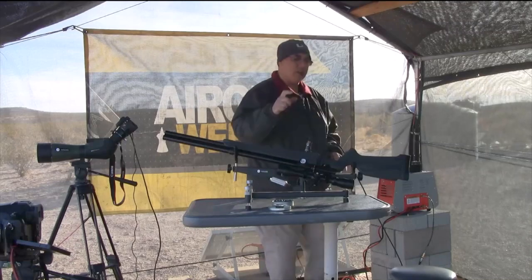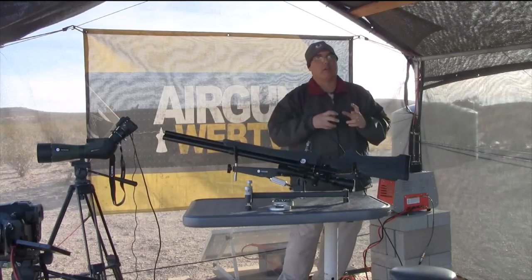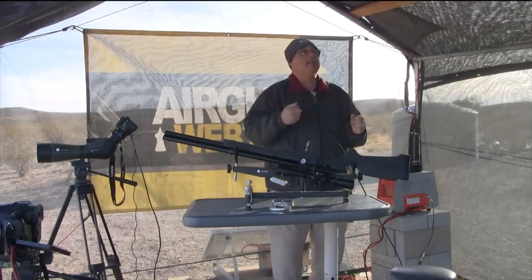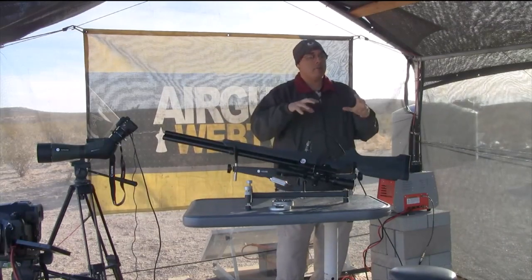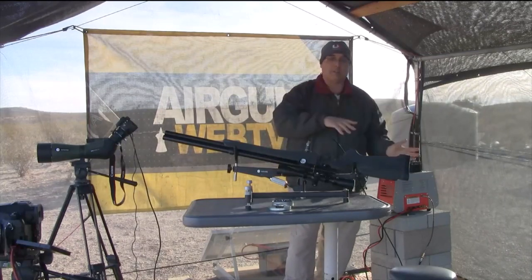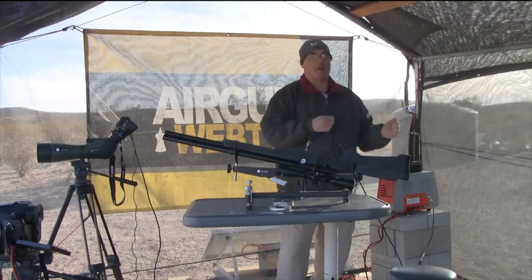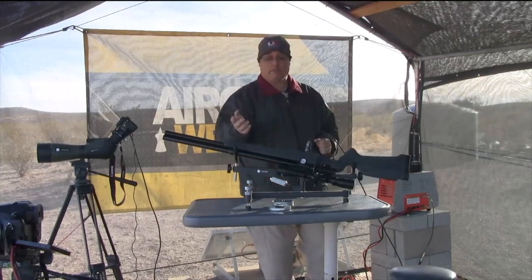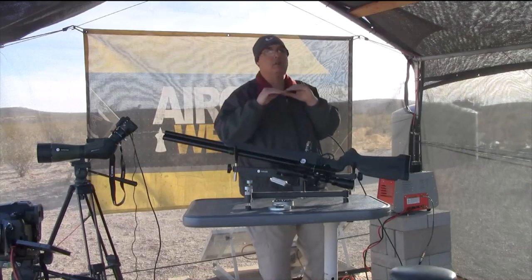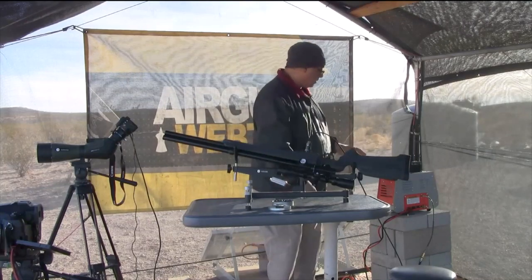It does work. And the other thing is that it has a circuit. So if it gets too hot, which probably won't happen today, as you can see, I'm kind of bundled up. It's a little chilly out here today. But as it gets too hot, it'll shut off. It cools down, and when you hear the fan stop, you know you can go reset it and have it finish filling up. So it is a manual restart system, but at least it knows to shut off when it gets too hot. It's a great safety feature.